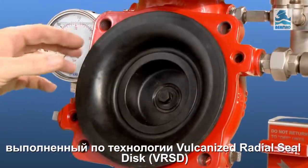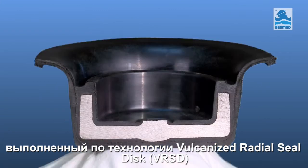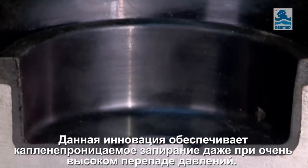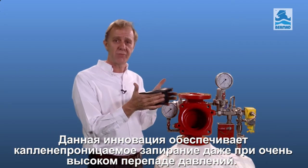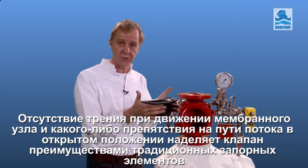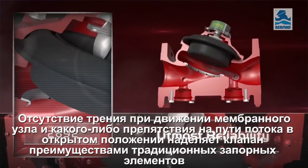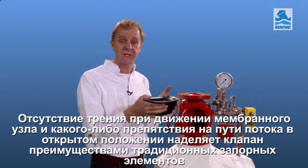The VRSD is made with a strong metallic disc encapsulated during the vulcanization process with a reinforced elastomeric diaphragm. With total peripheral diaphragm support, this enables the 400Y to keep the rugged pressure holding reliability of traditional steel disc valves, combined with the frictionless actuation, opening reliability and unobstructed flow passage of an elastomeric valve.